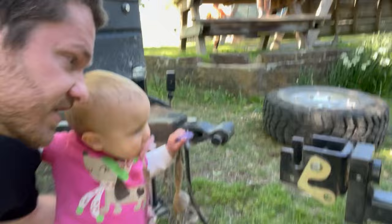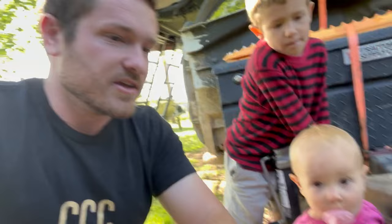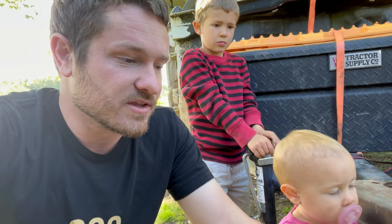Right down here in the bottom of the U, it's been smushed out just a little bit, and these actually catch on it just a little bit. That's just standard use — there's a lot of weight on it, it's bouncing up and down. Once this is locked in there's really no play, but over time that's going to wear down. I'm going to take a file and just take that little lip off, and that might help the plates that are having issues spinning around.